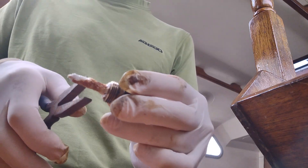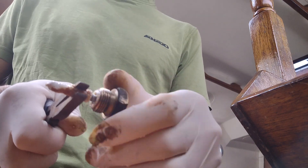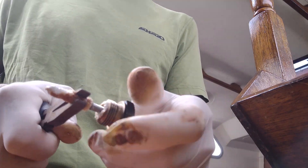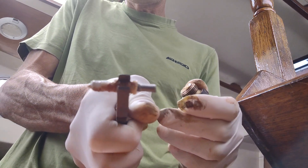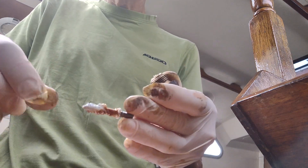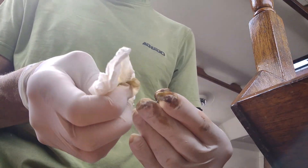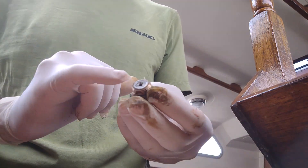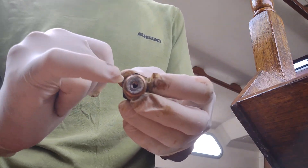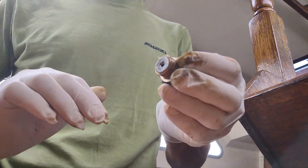We have to undo the core here and replace it with a new anode — it probably needs some cleaning. Here is the old anode; actually only a thread is left. It's been a long time since I last replaced it, unfortunately that was a mistake. The hole inside is a little bit clogged, so I have to clean it up, and after that I will replace the new anode and screw it inside.